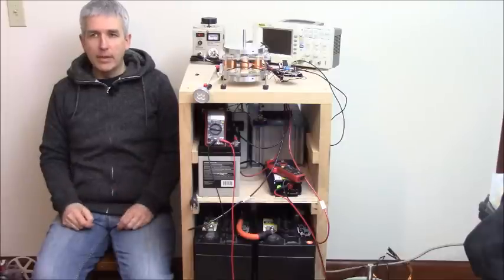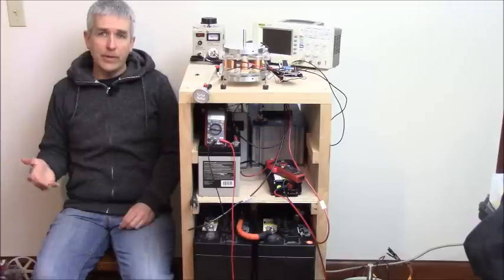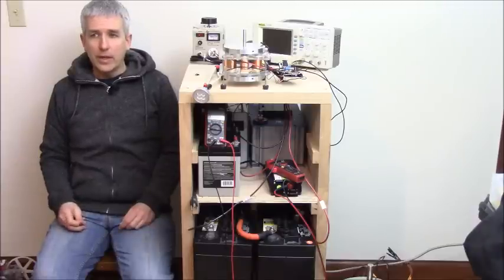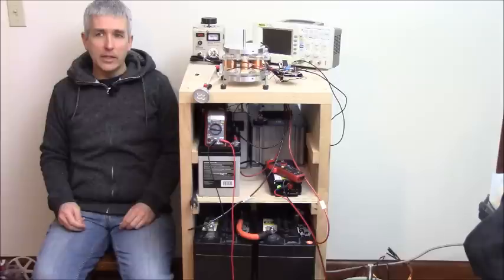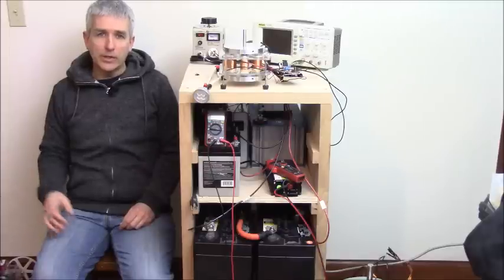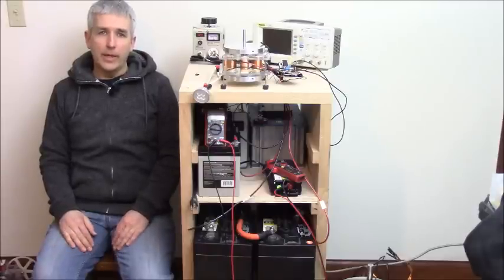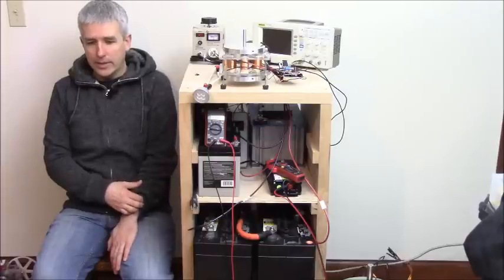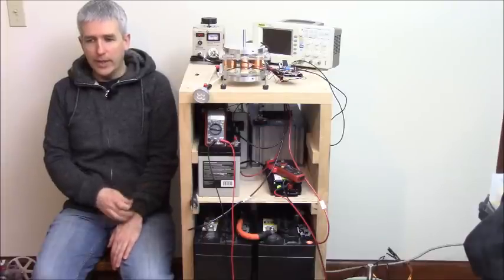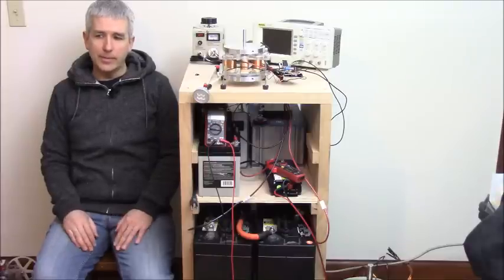And if they're the same, how do you reconcile that? Because with a battery, to charge a battery is a loss. With the internal resistance and so forth, it can be quite a significant loss in not only charging the battery, but discharging it across the load. And there's a whole formula for that at the rate that you're discharging it. That's dealing with the C rate differences and Peukert's law, but that's another subject.